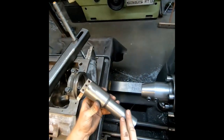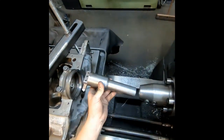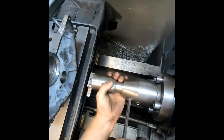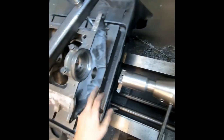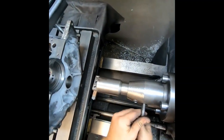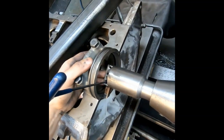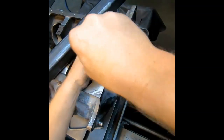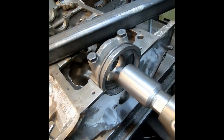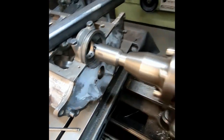I'm going to swap out for this tool holder, because typically this tool holder holds a tool that was ground on a 15-degree angle, which is great for giving a bore like this a nice little lead. Then we just adjust it, tighten it down, and hand feed this one as well. That should do the trick.